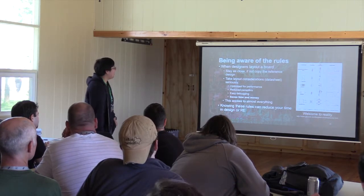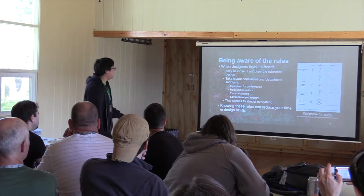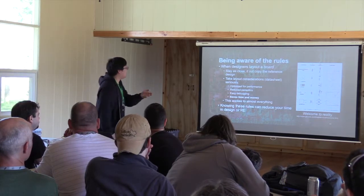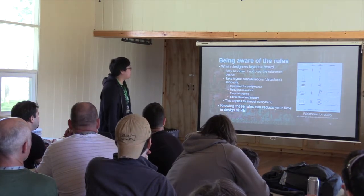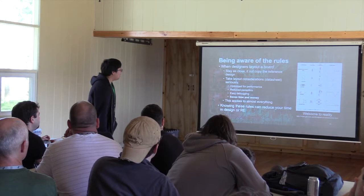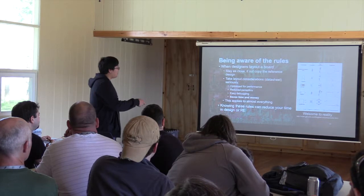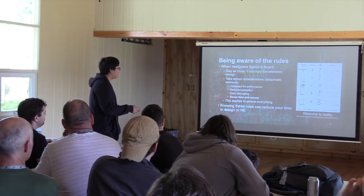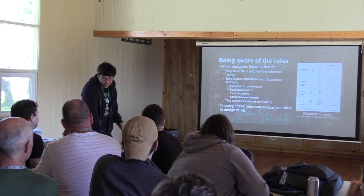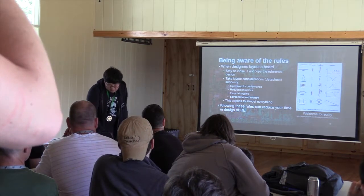When you're a designer, you have to realize that a wire is not just a wire anymore. It'll start to exhibit properties at high frequencies as an inductor and a resistor in series. So you can get all sorts of bizarre things from that if you don't lay out your board properly. Designers put in a lot of effort to make sure that a lot of this stuff is mitigated for. And it's all about optimizing board performance and reducing those parasitics. And it's what saves time and money as well.